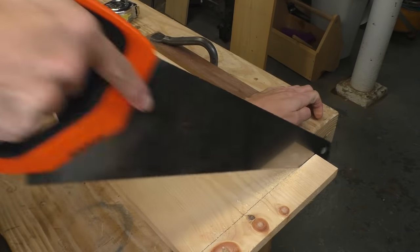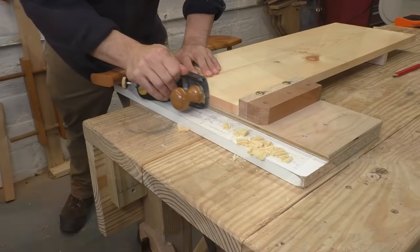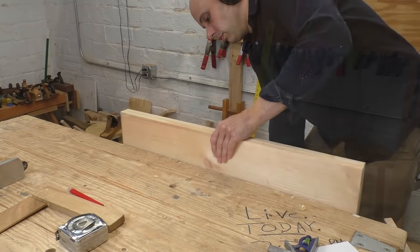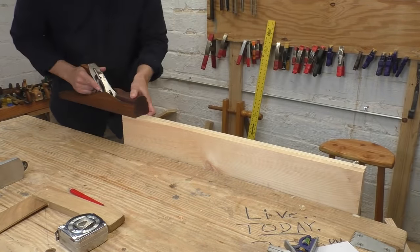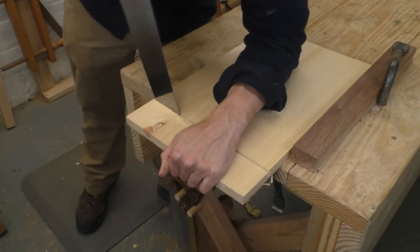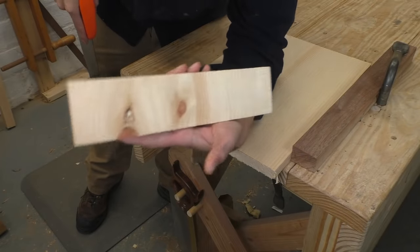The front and back boards will have some important joinery and they need to be identical. So shoot them to the same length, then put them together and joint a reference edge. Make sure they're labeled and set them aside. The two ends are about half the length of the lid and they can be made from leftover stock. Trim these boards to get rid of knots and make them the same size, but don't shoot them now — just cut them and move on.